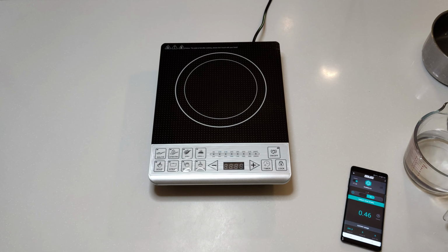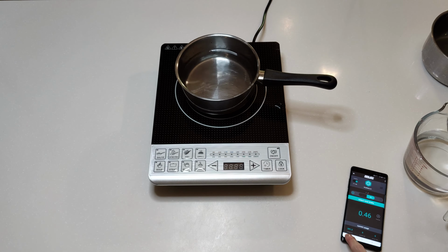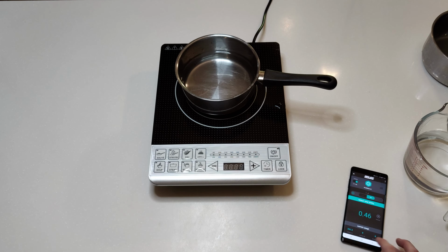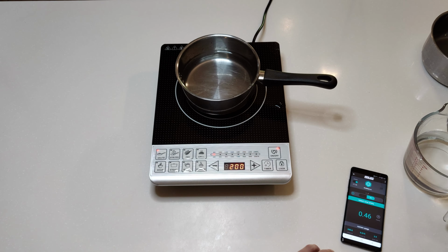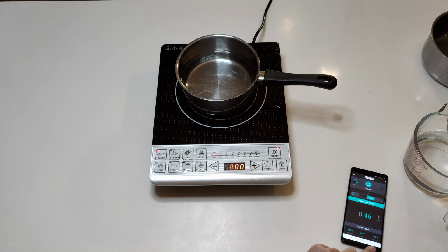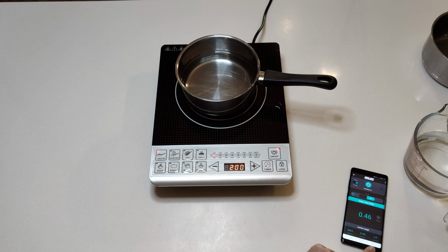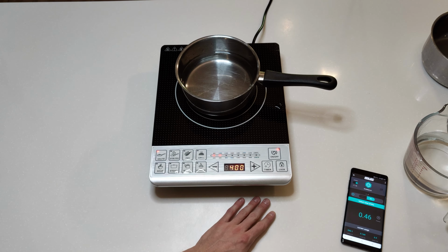That's cooled down, and I've got a bit of water here to absorb some temperature. Now it's down here, see the voltage, the current, the power. Ignore the history, that's not really relevant here. I don't think this gives us anything better, but see what it's doing. So we've got the on-duty cycle, we've got to have a look at what it's doing. It does lag a bit though, so it looks like it's pulling 1000 watts then. Yeah, close to 1000. So this is catching some of the duty cycle in the refresh. Let's go up and see if it pulls more than 1000 here.